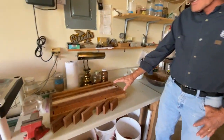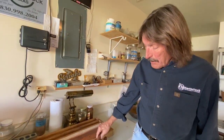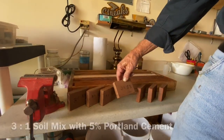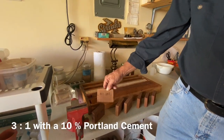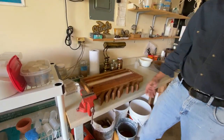But before we make this lime block, let's take a look at what we've got here. These are three blocks I made a couple of weeks ago that are just soil — two different soils from the land in Oregon County, mixed two to one, three to one, and four to one. Yesterday we used the three to one mix to make different percents of stabilization. This is a three to one soil mix with five percent Portland cement, this is seven percent, and ten percent — this is a real beauty, three to one, ten percent Portland. These are just a couple of days old, so we're not ready to drop them into water yet, but when they cure we will, to see how much difference the various percentages of stabilizer make.